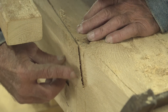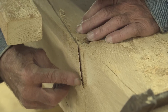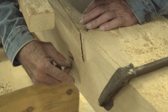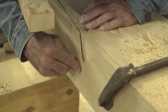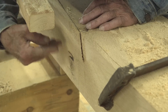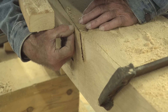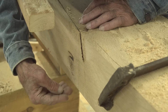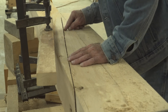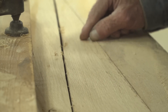Look at this now. I've cut it three inches deep and you can see the angle right here — that's the angle of the cut. It's like one and a half degrees or something like that. But if it was square, it would have come out on this line. So now when I cut from the other side, it's going to come up on an angle and leave a hump in the middle — and that's exactly what I want, because I can get rid of that hump like nothing. I don't want to go past the lines right here, so the lines I cut are still going to be controlled. Then I'll whittle it down in the middle until it matches the two lines straight across. I went over the pencil line just a tiniest bit, but that doesn't matter — I'm going to plane it all out anyhow, and there are traces of the pencil line right alongside it.